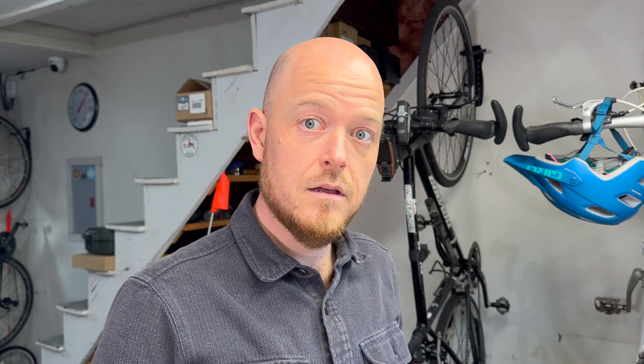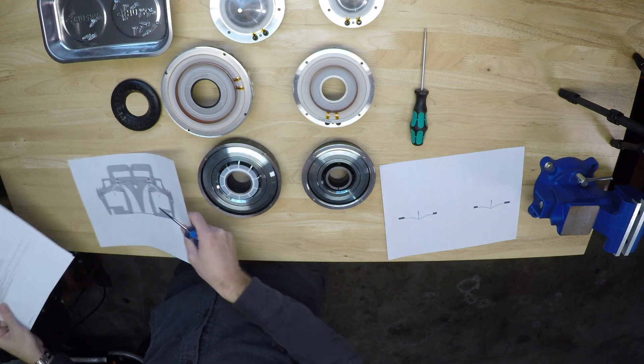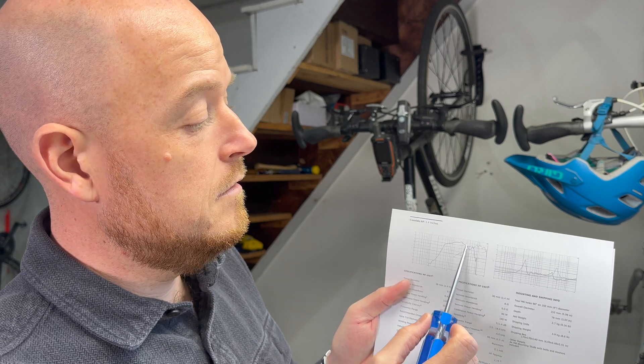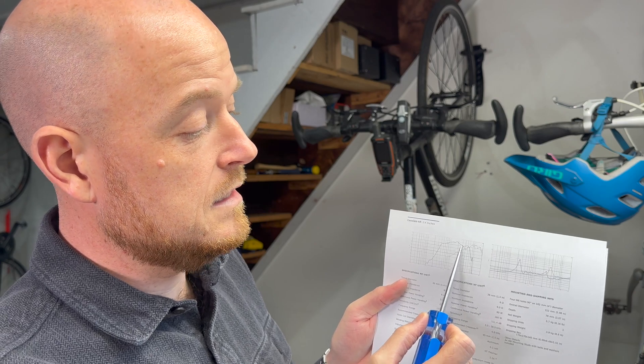So between the impedance mismatch device — which keeps the drivers behaving well over a pretty wide frequency range — and because you've got that driver overlap, this is free output. These two combine and add to be pretty much flat through here instead of down like 6 dB that you see here. The result you get is lower distortion and higher output over that critical octave. And that octave is right in the middle of the consonants range of human speech, which is really important for intelligibility, especially if you're doing really long throw stuff.